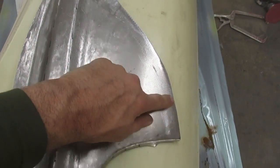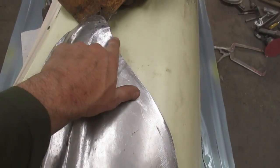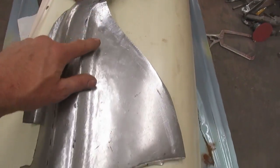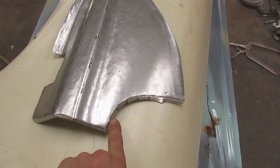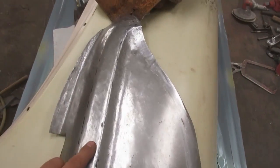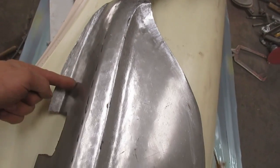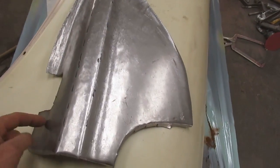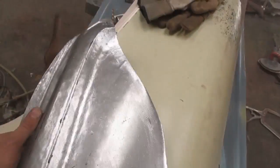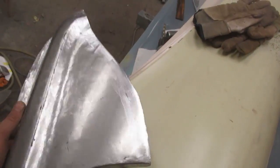First thing I want to do is weld it. Pin that down here, get this seam looking good, fit the end here. Then we'll walk it over to the car and line it up with the door. This can get plug welded to the brace, and then we'll do the final fit on the car.